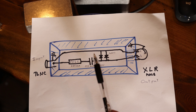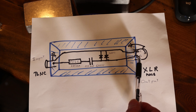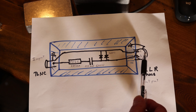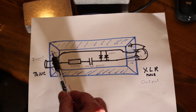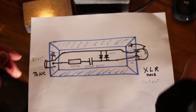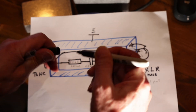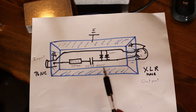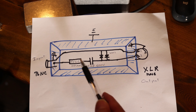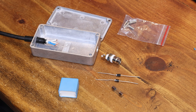The output goes into the XLR on pins two and three, and pin one which is ground is attached to the case, as is the BNC ground. It's very important that your case is grounded — you need to run a wire and ground your case. If you're measuring some high-voltage stuff and accidentally reverse the polarity, you could suddenly have 400 volts sitting on your case — you touch that case and you could die.